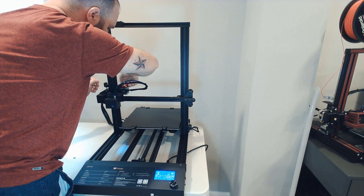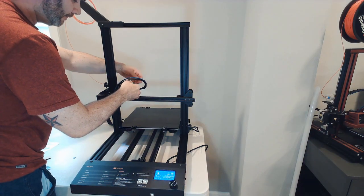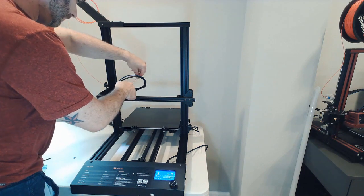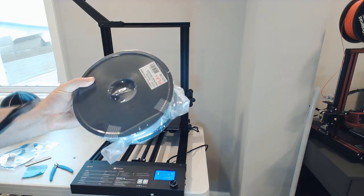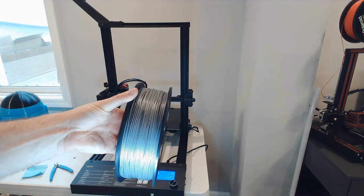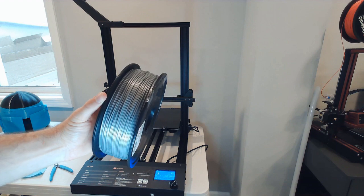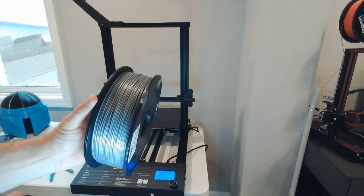After that it's on to bed leveling — I did it manually, going around all four corners five or six times. Then we calibrated our E-steps. I loaded the filament through, snipped it flush at the extruder, extruded 100 millimeters, measured it, and made sure I was getting 100. I was — it was perfect. Then I took a look at loading filament. This is inland filament from Micro Center; I usually have great success with it, but this spool and inland spools lately have been wound pretty sloppily. Take a look at your filament and make sure it's wound properly — I could already see it wasn't tightly wound, so I kept an eye on it while printing.